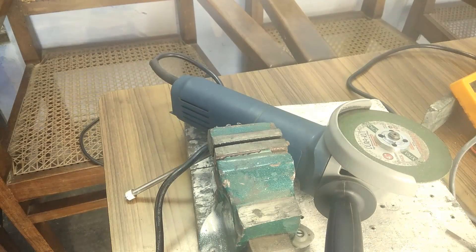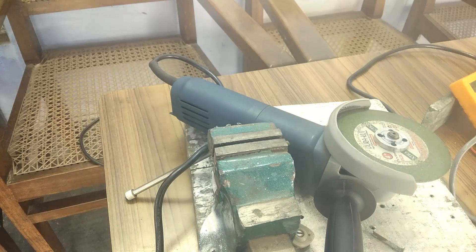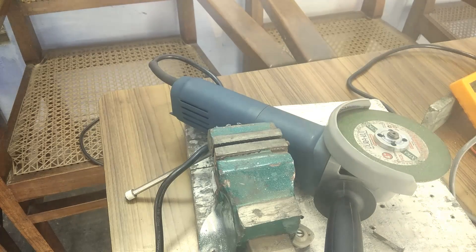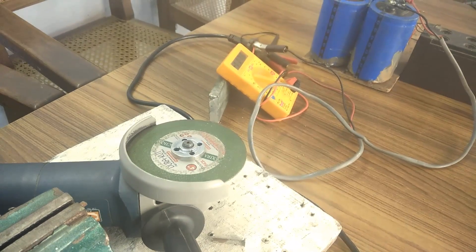The angle grinder is operating pretty well. It took about two to three charges to cut through a nail. This is just a concept — I am using only two 20-watt inverters, so together they make about 40 watts. If you use a single 100-watt inverter connected to the battery and then to the booster, the capacitor bank will charge much faster and you can cut even thicker metals, maybe in a single charge. That would be all about the video — thank you so much for watching, please hit like, share, and subscribe.